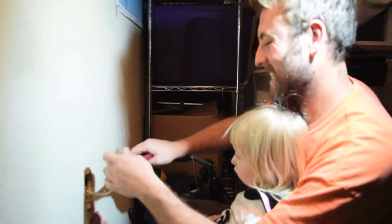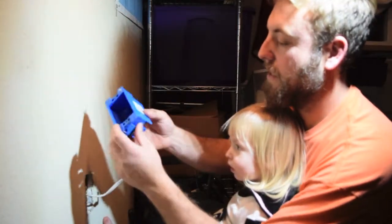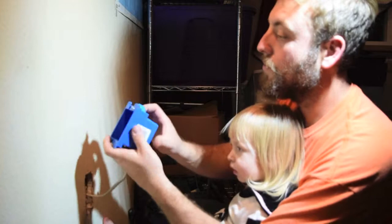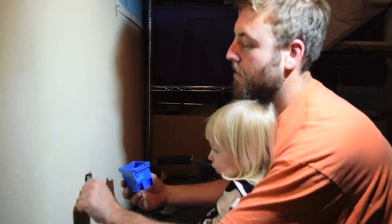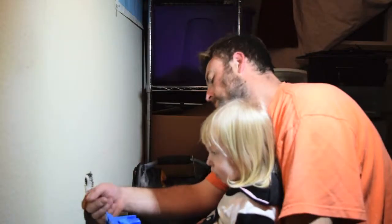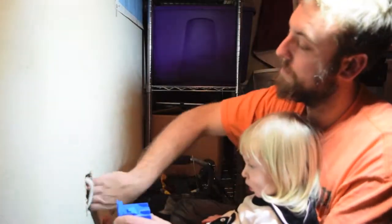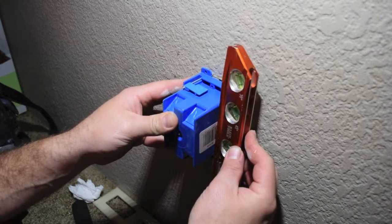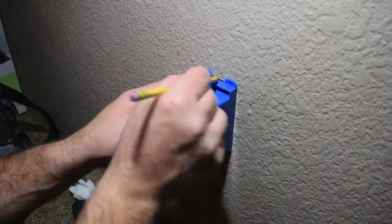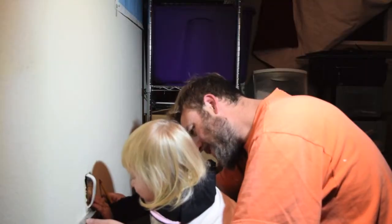My cut-in box, also known as a remodel box. Take the wire and just tuck it in a little bit. Check to see which side you have a stud — I don't have one on this setup. You've got to level it.